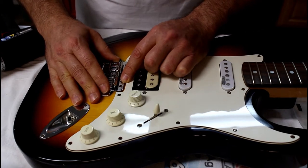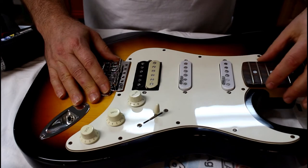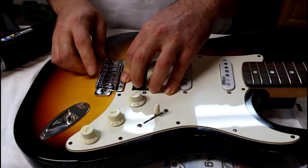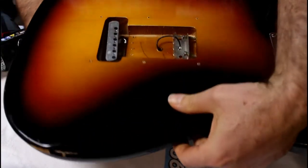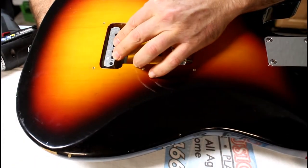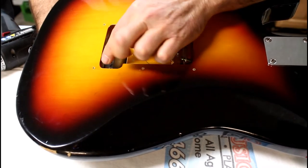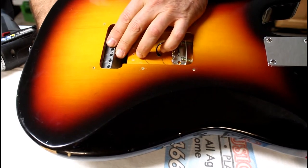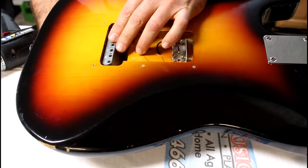But being able to do this and fit it into the correct size for the neck width and then the tremolo screws, I think it's going to work out a lot better. I'm already thinking though that the block might end up being a little big for this cavity, but we'll put in a couple screws in there, and we'll see what we have to do. Maybe we'll just take a little Dremel tool and route out a little bit of wood there to give this guy a little more movement.